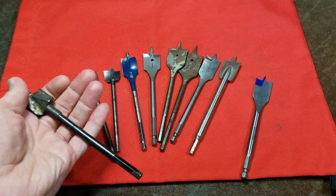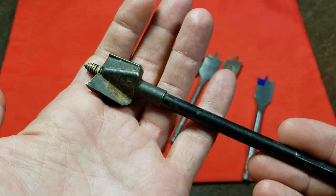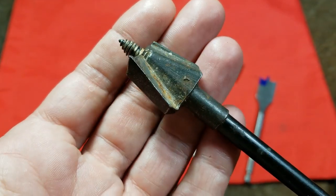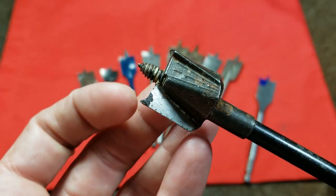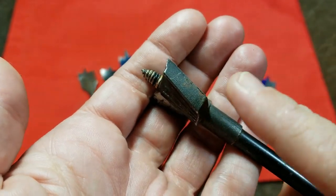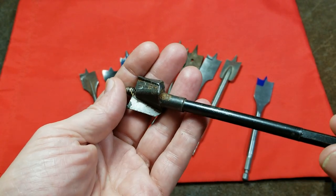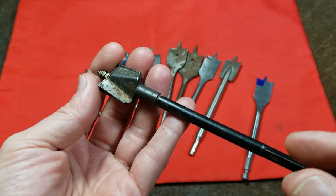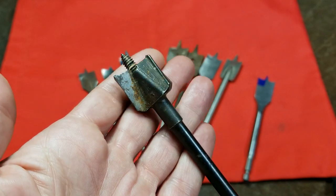These are all reasonably sharp and I'll be running them at 1200 RPM. This is a Plantor — I always mispronounce their name — but these used to be famous decades ago as some of the most aggressive and fast-cutting, as well as durable, wood bits. These are self-feeding, kind of a combination between a traditional self-feed bit and a spade bit. They have this large forged section which is really more like a spade bit. It has two little tips with a very steep rake angle and very wide sides. These do get a little hotter because there is more friction. They made these in all sorts of sizes and they are always notorious for — if you got them a little bit too far sideways — this big broad surface here would just jam right in the hole, especially on the large ones. But many people swore by these, and believe that as far as styles of bits similar to spade bits, this was probably the best that a spade-style bit ever got.